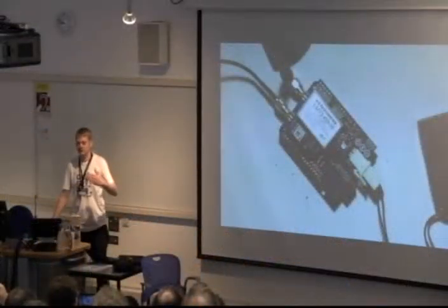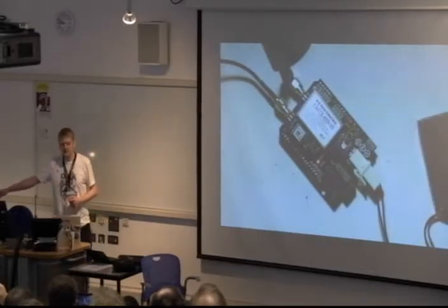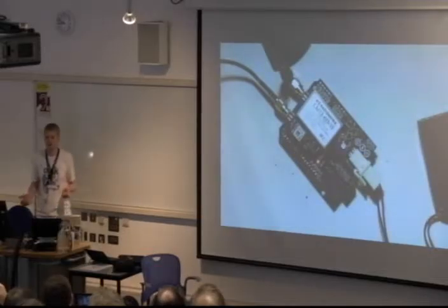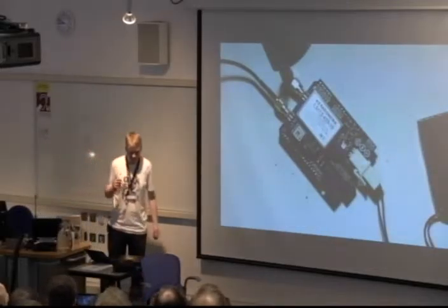Hi, Dave. You said about the stubby antenna, but they're variable. Yes, some are quite good. I'm so far away from a lot of the launches that I can see quite clearly the difference in signal strength between a normal antenna and a quarter wave wire one. By the way, I'm selling these with a kit that lets you make a quarter wave antenna, because you can't ship a quarter wave antenna, they're just a nightmare. They'll just fall apart. So the quarter wave antennas are better.